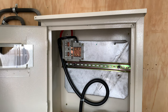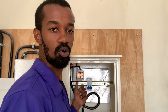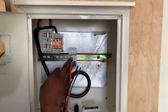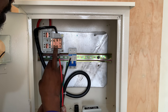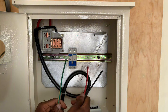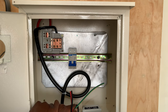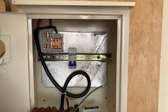We will wire this double pole switch to our double cutouts, having our wires here connecting the double cutout to the double pole switch. Let us talk about the earth connection. The earth connection will be tapped from here and will go all the way to the consumer unit. It will also be connected to the meter box surface because it is metallic, and the other part will go all the way to the earth rod.